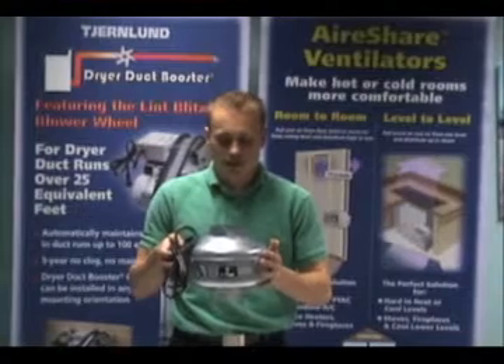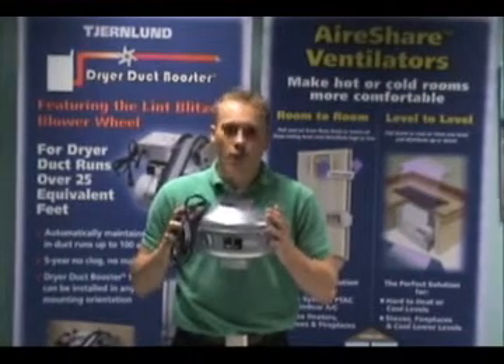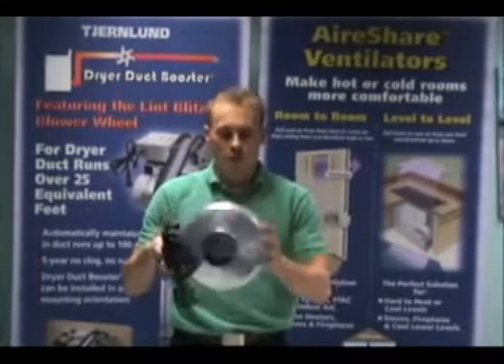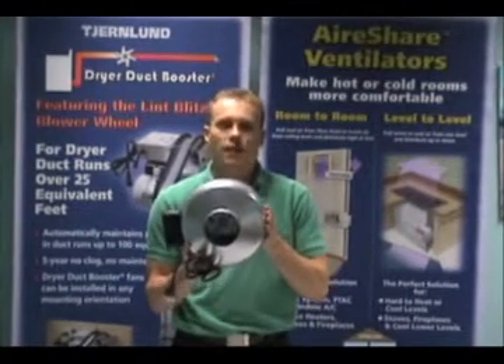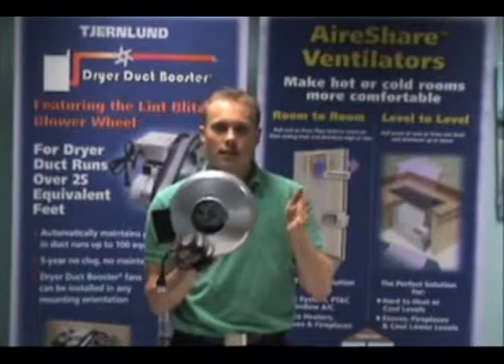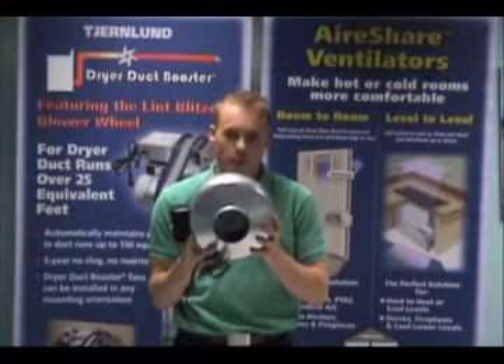The third fact is the size of these fans. Based on their model name, they have a 4, 6, or 8 inch inlet and outlet, but the width or the footprint of the fan is about 10 inches on the 4 inch model and about 13 inches on the 6 and 8 inch model, adding 1.5 inches for the part where there is the electrical box.